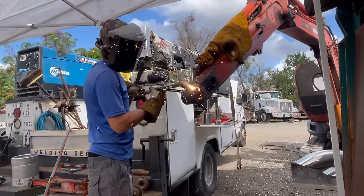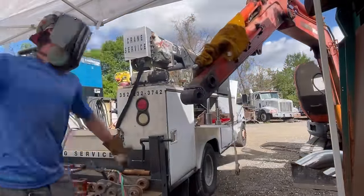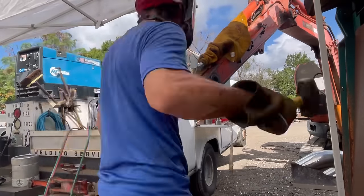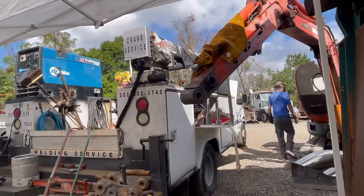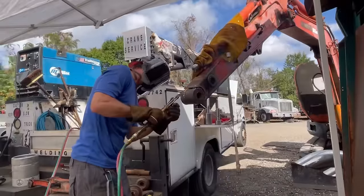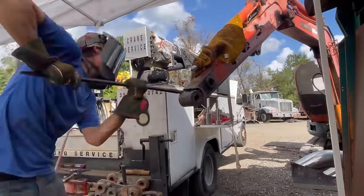The reason I'm having such a hard time cutting this thing off — and I didn't realize it at the time — is that it's actually welded on the inside. There's a strip of metal connecting the two bushings on the inside and they're both MIG welded. After a little more work I'm able to pop it off, but I actually have to cut down through the bushing and then it pops off.